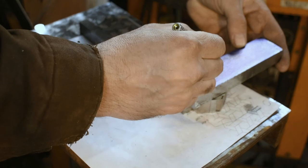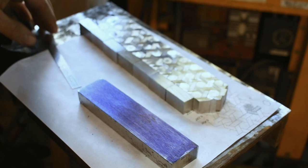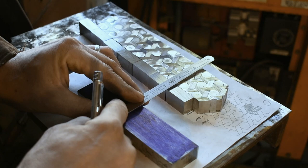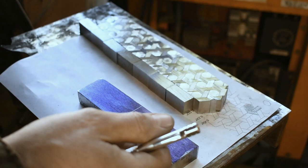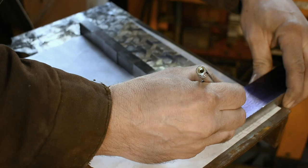Here I'm trying to figure out a method for accurately finding the centerline of that angle, because it is not symmetrical. Then actually making an angle guide out of a couple pieces of stock — you'll see that in a minute. I've got the width and I'm scribing a line for a horizontal bandsaw cut. You can see that I etched the faces of all of those edge chunks so I could make sure they were all mirrored to each other and laid out right.